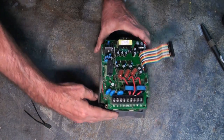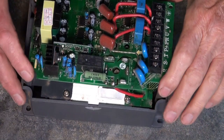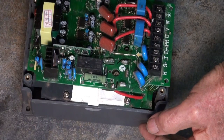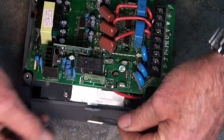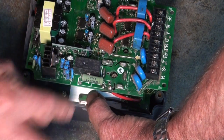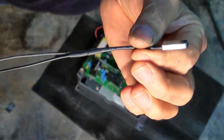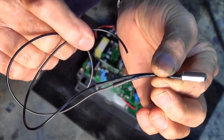Although I'm a bit reluctant to do this, it looks like the only way to get at the heat sink itself. There's a set of six screws going through this circuit board clamping — I'm guessing they're IGBTs or something similar — down to the heat sink. Now that's loose and I've got access to these four screws. I really don't want to disassemble this any more than I need to. You can see the back of the heat sink just here and I could undo these four screws, but I'm starting to think I don't want to. All I really need to do is clamp that thermal switch to the back of the heat sink, so I'm going to make up a little clamp. I've extended the wires on that so they can reach from the heat sink up and around the board and connect onto the power wire for the fan.